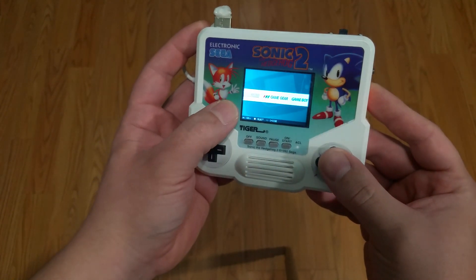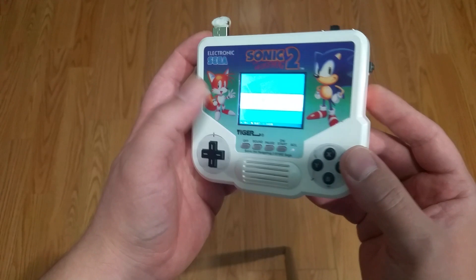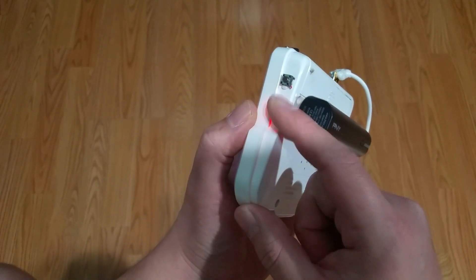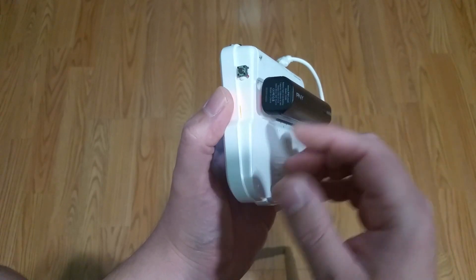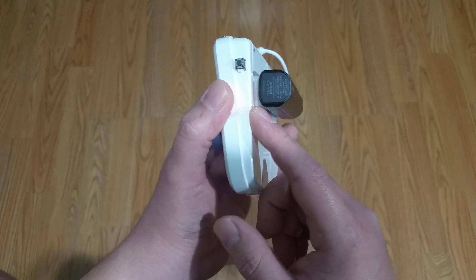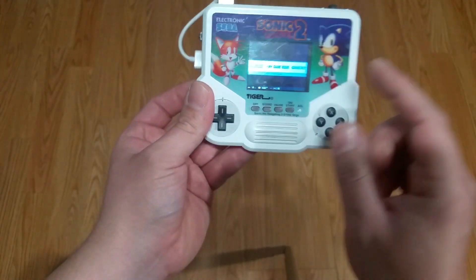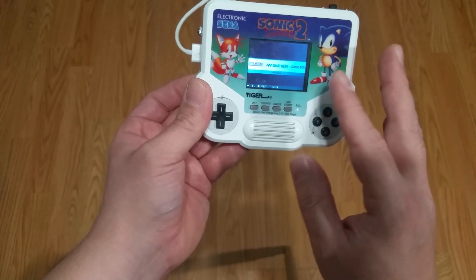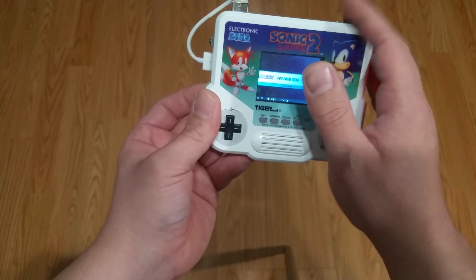The Raspberry Pi Zero does not have an audio amp, so I used a USB audio device. When it's running you can actually see the red light that comes from the USB audio device. I could have painted the inside or covered the LED, but what I like is that whenever it transmits audio it blinks, so I know it's working. When I turn the machine off I have to properly shut down the Raspberry Pi, otherwise I may corrupt the SD card. So whenever I shut it down through RetroPie, the USB sound card turns off and then I know it's safe to power it off.